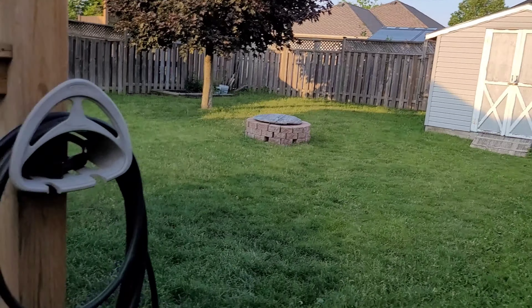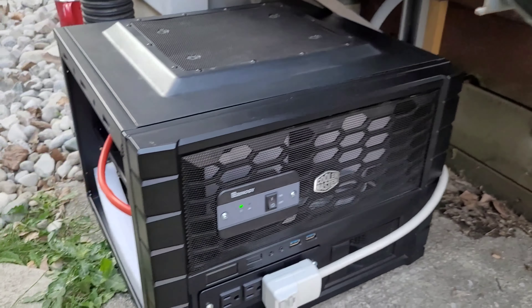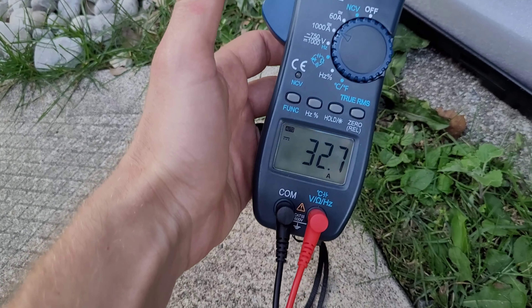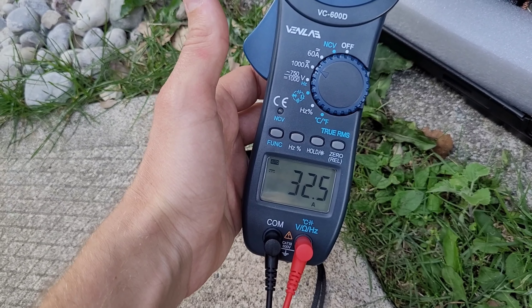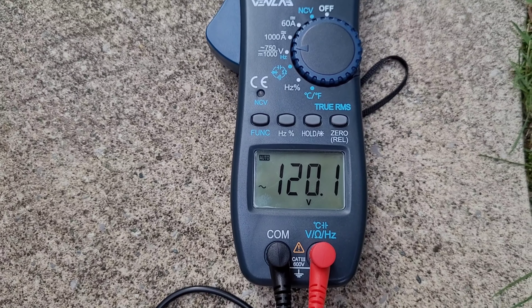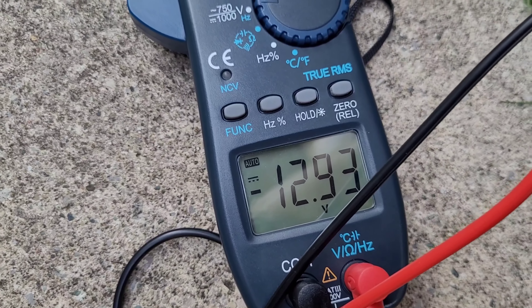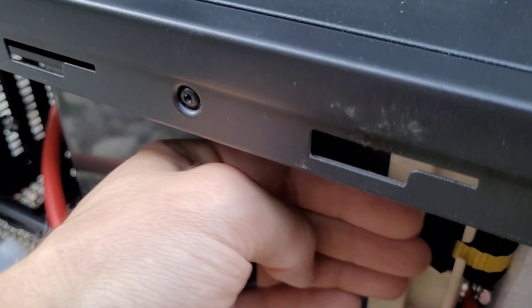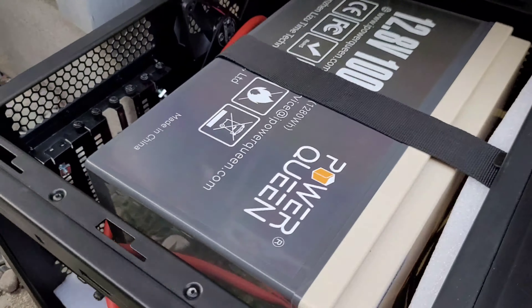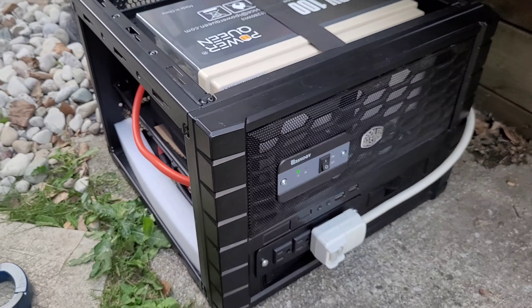It's after 8 PM — you can see how low the sun is, my backyard is fully shaded. Checking the service valves — there's a nice drip coming off each one, everything is cooling nicely. We're at a little over the one-hour mark and it's still running strong, no issues whatsoever. We're still pulling about 32 amps, around 400 watts. AC voltage is sitting at 120 volts on the inverter side — no low voltage issues for the air conditioner. The battery is still just shy of 13 volts DC — 12.93 — and it's totally cool to the touch, no heat whatsoever.